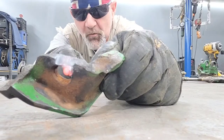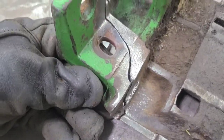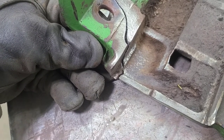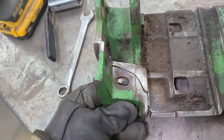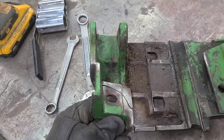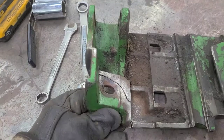That's cast steel. We're going in with the low hydrogen rod. When you do this puzzle piecing, you can't always expect it to go together perfect. Where the bottom is kind of tweaked out, that's from the part bending when it finally broke, so don't expect that area to line up exactly. I'm looking at a casting line right here — I know that line is going to be straight. It's safe to assume the straight part of the top would be parallel with the rest of the assembly. I think I've got it where I'm ready to tack it up.